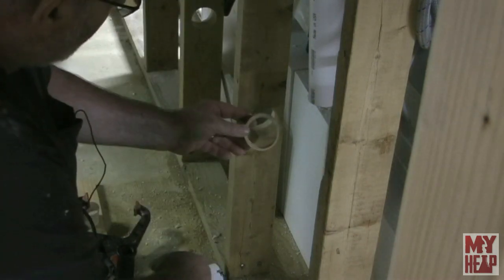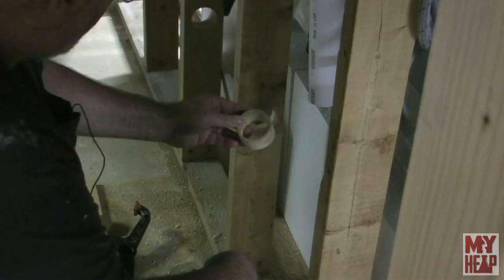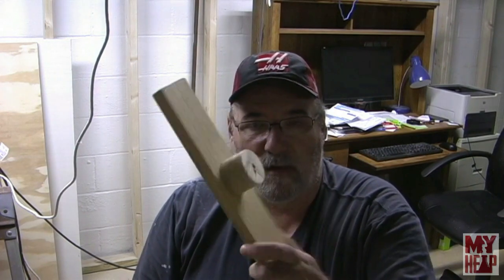Let me come back over to my bench and close out. Excuse the lighting — I've got temporary LED shop strip lights strung up. They put out enough light to see the work but probably aren't great for videoing. So anyway, that's my tip: when you have a hole made with a hole saw and you need to make it bigger while keeping centered, make yourself a little jig like this. Cut a plug out of material the same thickness you're cutting, put it on a backer board, clamp your backer board in — and it looks like it works pretty good.